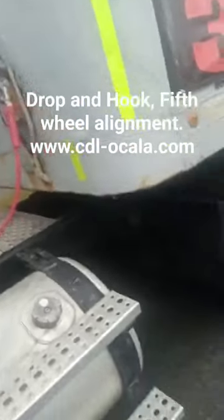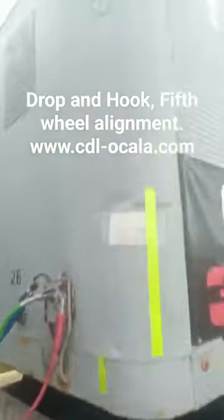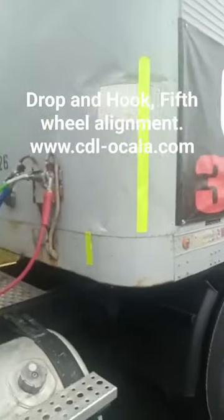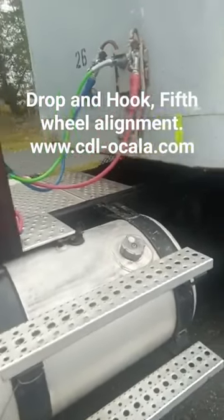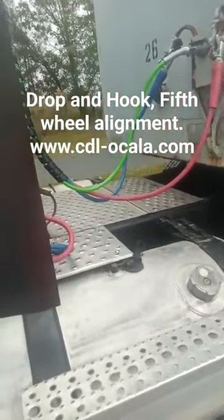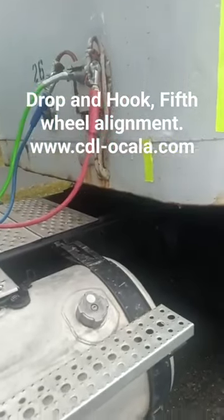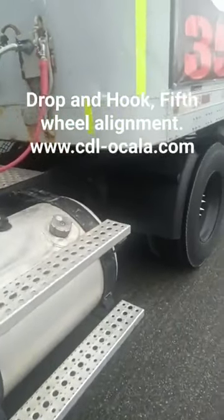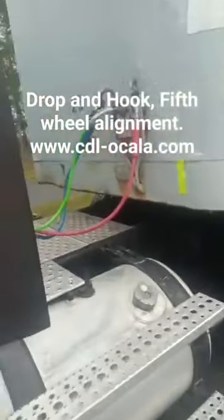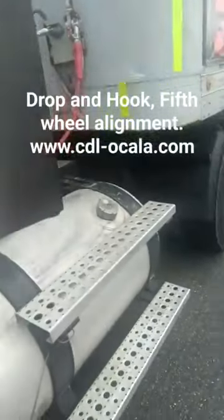What I would do, I would put on my four-way flashers, my lights. Check all my lights and make sure everything's working. I start on the left, walk around to the right. You always want to check the right side because if somebody hits you on the right side, they're most likely not going to say that they hit you. So I already did my connection. I did my tug. Did my connections. When I would do my brake test in here, I can do the tug.